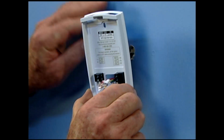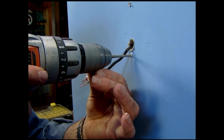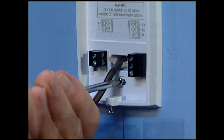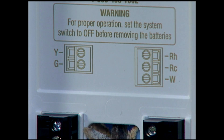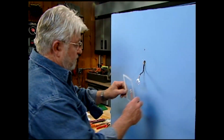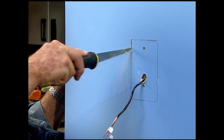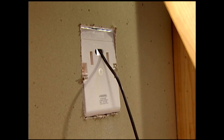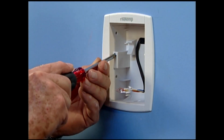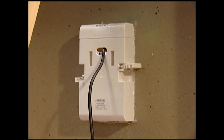Place the new base in position on the wall and mark the location of the mounting holes. Drill the holes, insert plastic anchors, tap them into place, and mount the base plate. This thermostat has a printed wiring diagram. All you have to do now is attach the wires to the corresponding terminals — no guesswork, no trial and error. Finally, snap on the cover and you're finished. For a sleeker look, consider this flush-mounted thermostat. To install it, trace the inside of the template included with the thermostat. Cut out the marked opening using a wallboard saw and set the recessed housing in place. As you begin tightening the screws on the front of the housing, wings flip out on the backside of the wall — continued tightening pulls the wings snugly against the surface, holding the box securely in place.